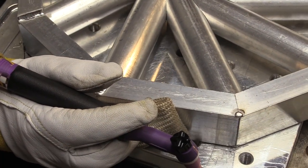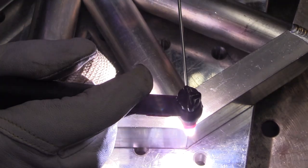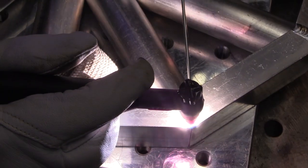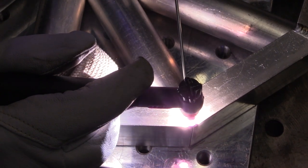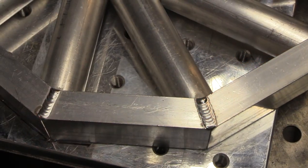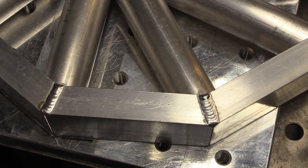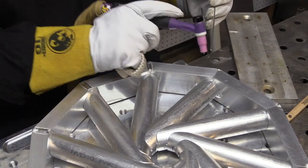A lot of great work is done by great welders using large gas lenses — there's more than one way to skin a cat when it comes to TIG welding aluminum. I'm just trying to show how well this No. 5 works and give a hint on why so many good TIG welders prefer it. I like to let the cleaning action work just a little bit before puddling immediately. Raising the torch and lengthening the arc slightly as the puddle raises in height is a habit I've gotten into that helps me clean a lot fewer electrodes.